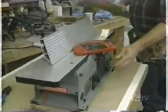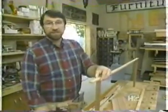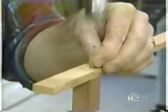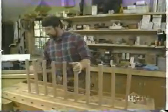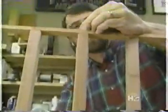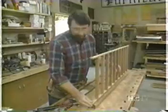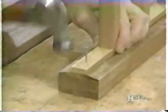The saw blade leaves a rough cut, which will be noticeable. So to solve that, I'm going to make a pass through my small joiner. The key to this baluster system is this little piece of lattice. I attach it to the balusters with a couple 3D galvanized box nails. Now we'll just flip it over and put the corresponding piece of lattice on the other end. Now I simply attach the baluster assembly to the rails I made earlier with some more of those galvanized box nails.